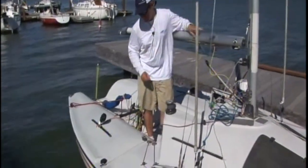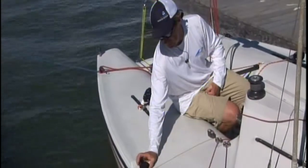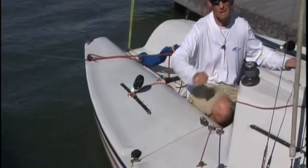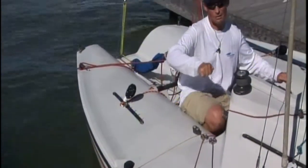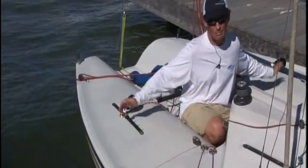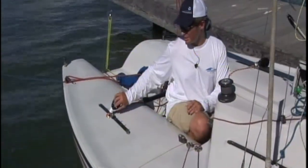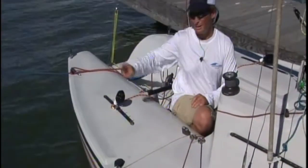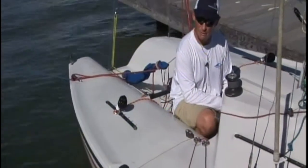Over here we have a spinnaker ratchet block. It's again a Ratchet-matic, very similar to the Genoa block. The Ratchet-matic is very nice for when you're adjusting the spinnaker, because again you get the ratchet or mechanical advantage when you pull on the line, but when you ease it, it disengages itself and becomes a lot more fluid. In fact, we recommend Ratchet-matics on the Genoa blocks and also on the spinnaker turning blocks on the boat. You'll find it makes your sail handling a lot more fluid, essentially.